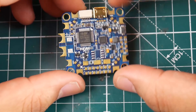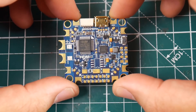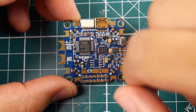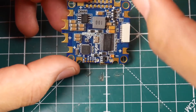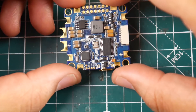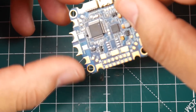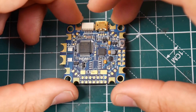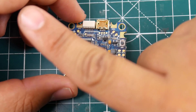This is the production model for sure. It's using an F3 flight controller and it has a built-in OSD, which is pretty cool. It only has a 5-volt regulator on board and it supports ESC telemetry — the proper ESC telemetry that I thought would be on Betaflight — which includes temperature and other ESC information.